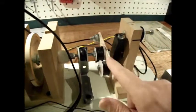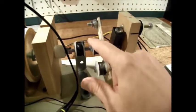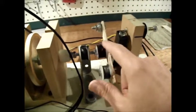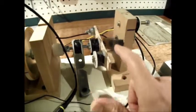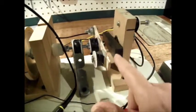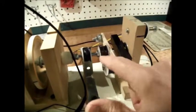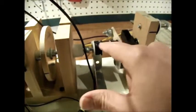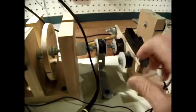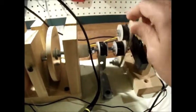I've also added this rotor on the other end of the motor. There's a coil here which is wired to this second coil, so that when the rotor passes by it, it induces a current through the bolt that's in the center of it. And then that in turn induces a current in the shaft — the main shaft of the motor — and then can be picked up by this one which is stationary around the shaft. It doesn't move. So that's one of my pickup coils.